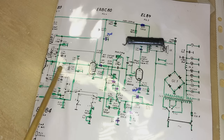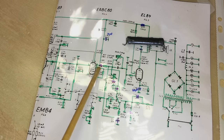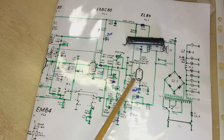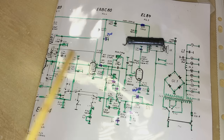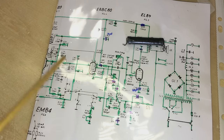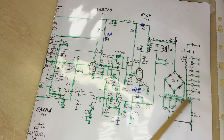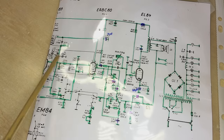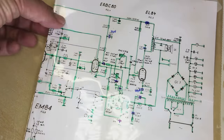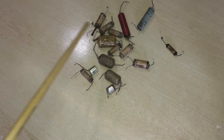So what I decided to do before powering it on with the tubes in place is actually replace the coupling capacitors. There are a few, and you can see which ones are going to send DC from any of the plate circuits to the grid circuits of the next tube. In checking those capacitors, obviously the resistors right in front of your nose - you don't ignore them - so I started checking them. In checking them, more capacitors came up, so I decided to go through the whole thing.